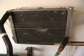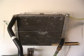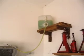We are using an automotive type radiator for cooling. The cap on the radiator has been modified so as not to allow pressure to build in the system. There is an expansion or overflow tank mounted above the radiator which is capable of holding five gallons of liquid.